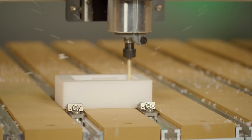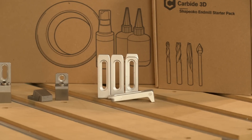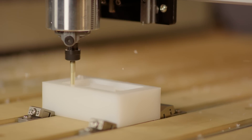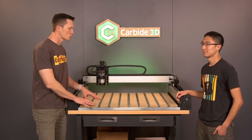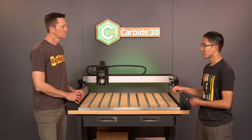You have a lot of places to go for different materials. One of the best things is the gator teeth and the tiger claw clamps — you don't have to hold the top of the work surface; you can utilize the entirety of the top of some work pieces. The gator tooth clamps let you clamp from the top of a part, and there's also a feature where you can turn them around and use an angled set screw to apply lateral pressure from the edge. The tiger claws are pure side clamping — they apply a lot of crushing force from the side to preserve full access to the top of your part. All of these give you a lot of flexibility, especially in the T-slots because you can place them anywhere. The strength coming out of these T-slots is significant. The rigidity of attaching your clamps directly into the aluminum T-slots gives you a lot of holding force. Once you tighten down that M6 screw, those clamps aren't going anywhere.